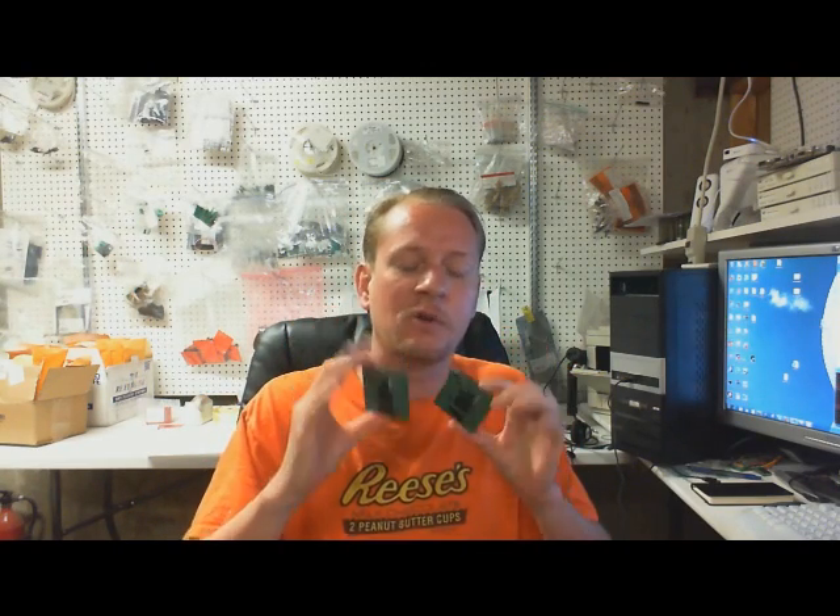This is using a modified version of the AVR8 soft processor to accommodate the new board — it's just UCF file changes. Uploading to the board; sometimes it takes a while, sometimes it's really fast. That blue light indicates that we do have a programmed bit file and the blinking light is for the serial ports. Looking at the serial monitor, it is transferring the ASCII table. In summary, the initial testing shows we have power, ground pins all soldered and working correctly, serial pins connected properly. I actually made two of them with the same technique and they're behaving the exact same way — so you can solder BGA chips at home on your pancake griddle. Thanks for watching!